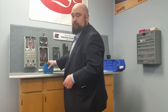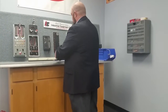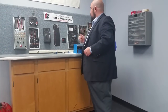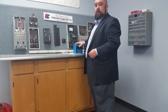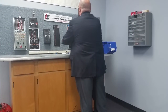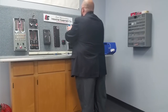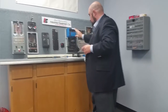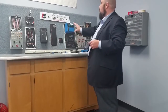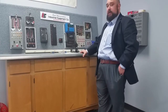Let's snap that into place. Put our display back on. Make sure we're set to UV on the flame simulator, and I have the proper configuration plug for the 7895 in place. Let's load it in solidly and start it up. We're in initiation mode — the operating control has called for heat and it's starting up.